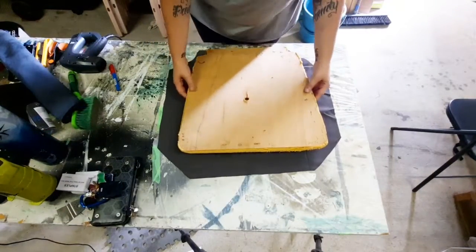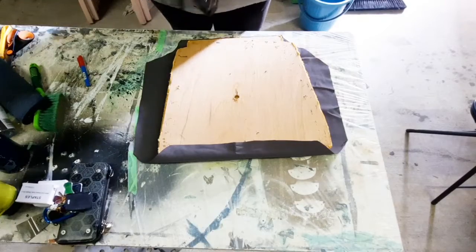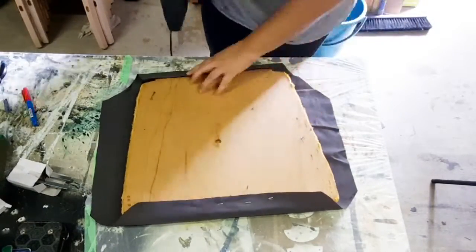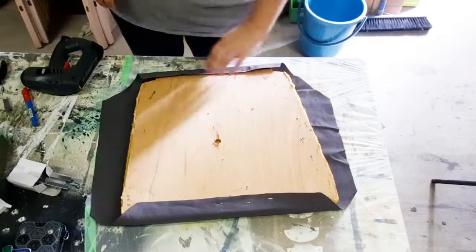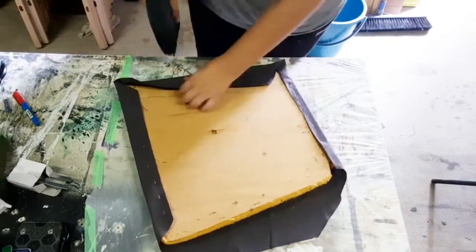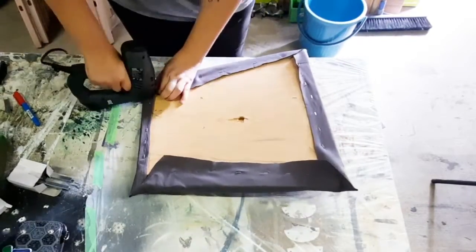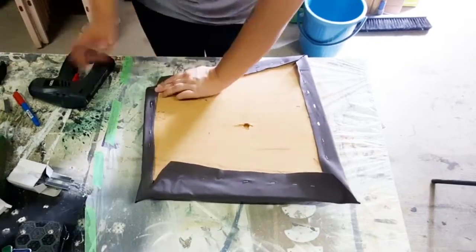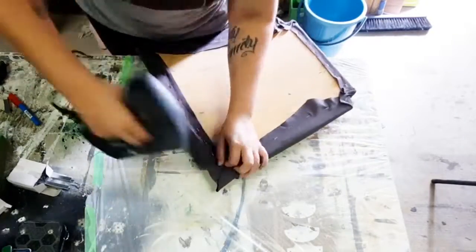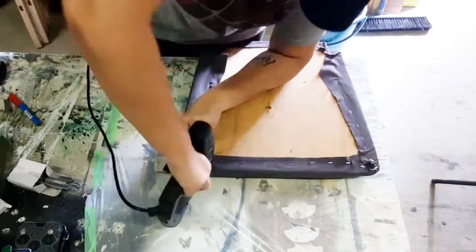This process is pretty self-explanatory once you do one — it's really easy. I'm using the Ozito electric staple gun. Start on one side, put in three or four staples, then do the opposite side to pull it tighter across the center — not too tight, but enough. Then go all along the edges. You want to pull it tight but without any pull marks. When you're doing your corners, kind of roll them up and over. I do have another video showing this in more depth, which I'll put in the description.